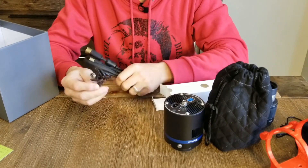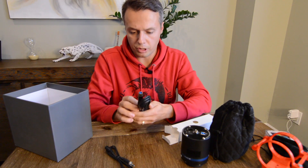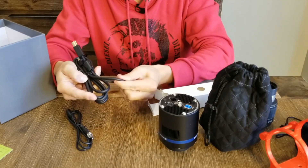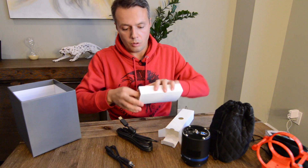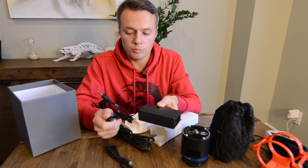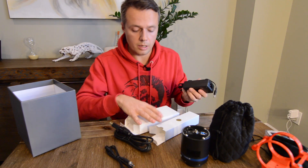This is the cable that attaches to the camera to power it — you need 11 to 13 volts with 3 amps of current. This is your USB 3 cable that runs from the camera to the computer, and it's really thick and sturdy. Finally, we have the charging adapter. If you're at home and want to set up in your backyard, you'll use this, but in the field you'll probably want to use a 12-volt battery.